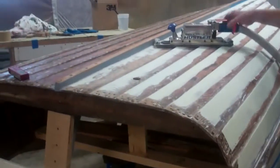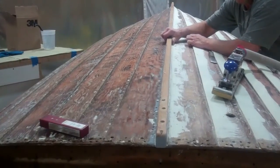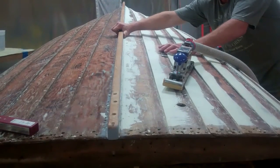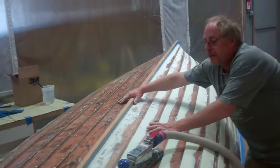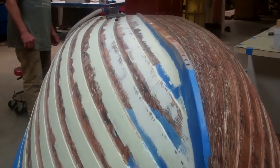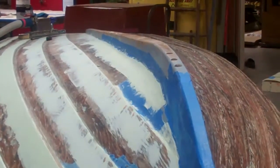The keel — I had taken it out and the old keel was in fairly rough shape, so I built a new one. The old keel varied from an inch and 3/16ths to an inch and 5/16ths; this new keel I made an inch and 5/16ths. I supported the boat where the hog was and then refastened the keel with 5200, which is now good and sturdy. If we sight down this keel now, it is absolutely straight — the hog is gone.